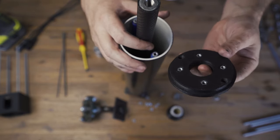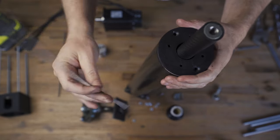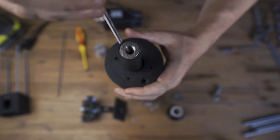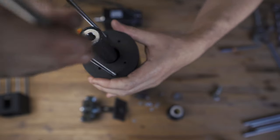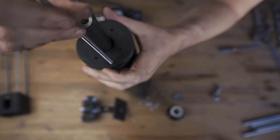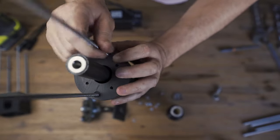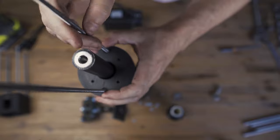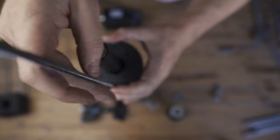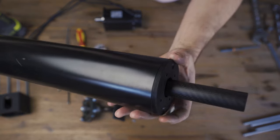We want to line the aluminium tube up — it can be tricky, but I have a solution. We drop the hat on and I've got a couple bits of M5 rod laying around. We get through and pick up the aluminium rod on one on each end — they can be used as locators. So when you get it closed, you can pull these through, line it up nice and easy. Once they're in and you've seated the top, you can undo this, and it's now home.